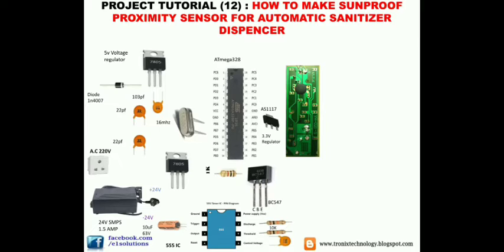You can purchase that MP3 remote from anywhere — it's a very small and handy remote. Just take out the circuit board from inside that remote. Remember, the upper portion of the board is positive and the lower portion is negative. We are also using an IRF540 MOSFET instead of a relay, because a relay is a mechanical device and won't last as long.